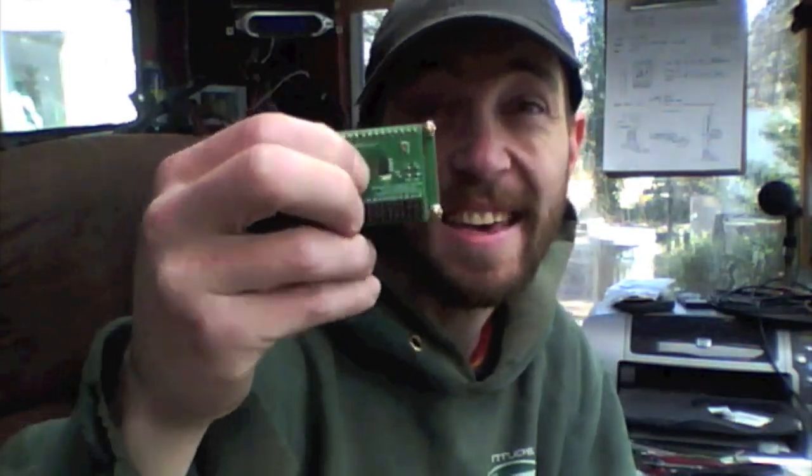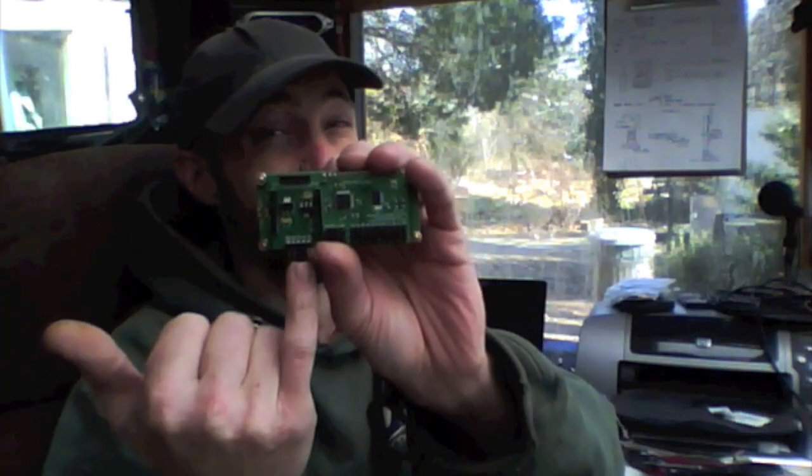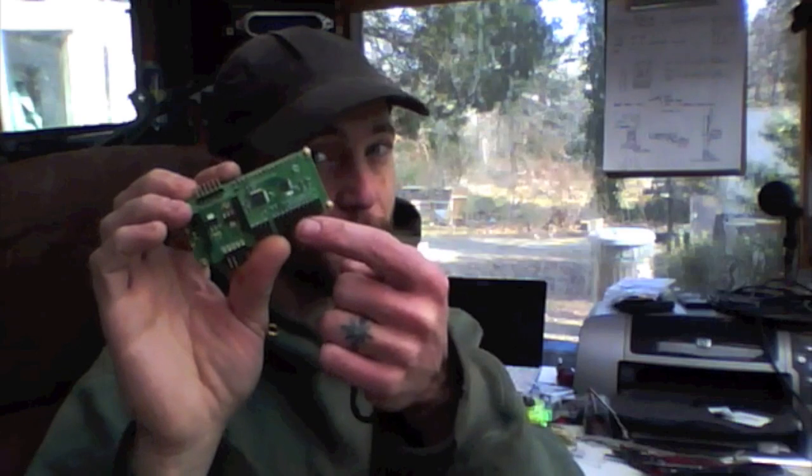You've got an ATmega 328. You've got yourself a 256K EEPROM on board — perfect for data logging, perfect for holding your preferences or user settings if this is being used in a controller of some kind. You've got your contrast adjustment, your backlight for the LCD off of the Arduino, your 6-pin standard programming header, and power coming in. With the Feta-duino, there's on-board battery monitoring — a battery monitoring circuit, right on there.